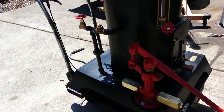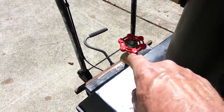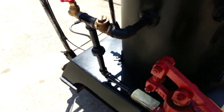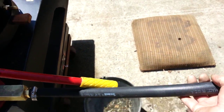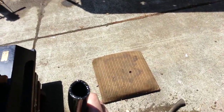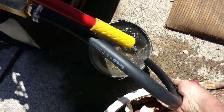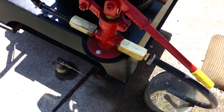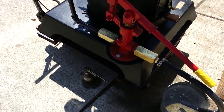The pump — got it going here real good. This is an air bleeder valve. If there's air in the pump, you want to open that up. Sometimes you even have to take the hose out and put water down the hose — just fill the hose up with water and pump it a few times. As soon as the pump gets water into it, the check valve here will keep it from coming out, but you've got to get it into the pump, kind of forcing it sometimes.